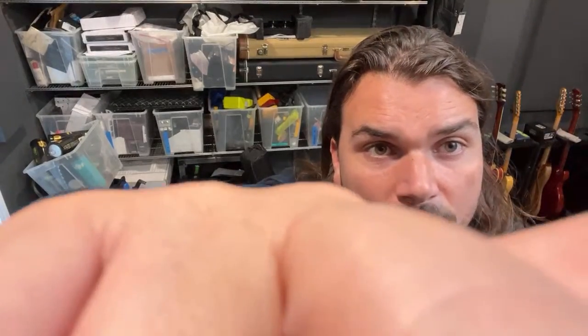Sean Roberts is an audio engineer. I don't agree with the naming scheme. Out should always be sends and in should always be returns, regardless of whether it's on an amp or a pedal board. I'm not disagreeing with that. And I said so when I was talking about the effects loop, that the send is an output and the return is an input. So I don't know that we have any disagreement there. I'm just talking about how it might be named on the pedal board. Often they'll label an output from the pedal board as return because it's going to go to the return, and it will be an output buffer that's driving it back into that input. That's generally how they'll be named on a pedal board. They don't usually call it a send that then matches to a return. It's usually named as the same thing that it's going to. But no, I think that was corrected in my description. You can tell me if you think otherwise.